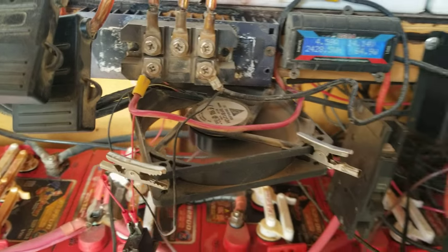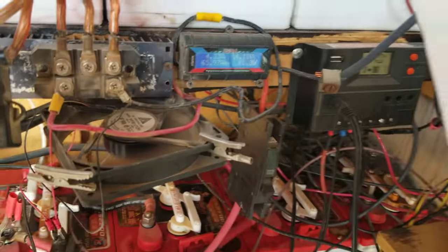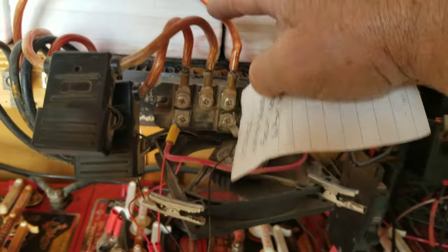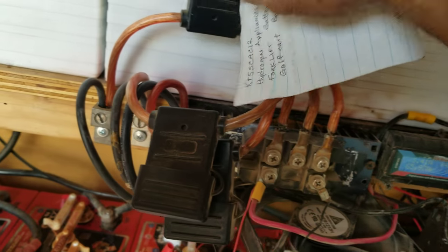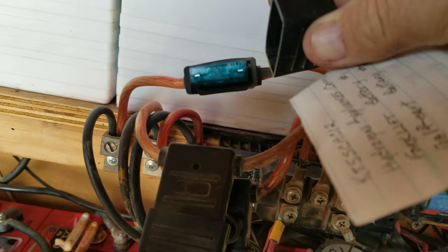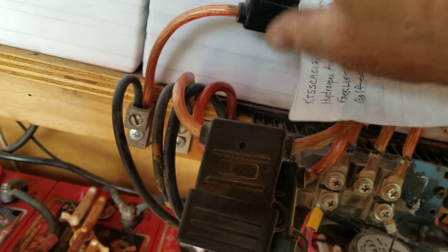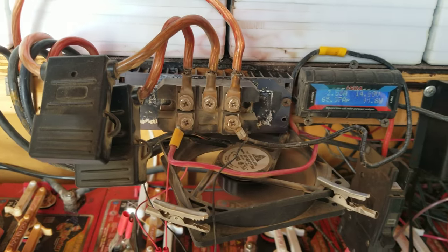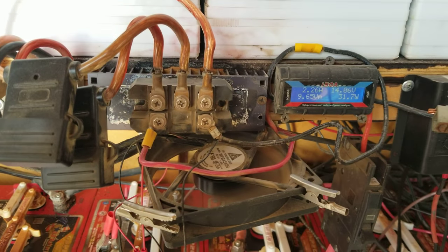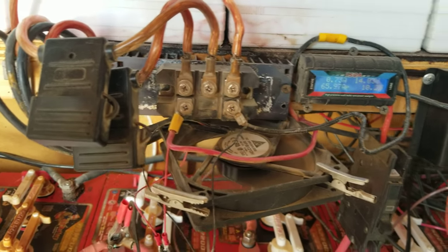Then that goes directly to the batteries — positive and negative — and I put a breaker switch in the positive side so that if I need to disconnect it from the batteries for any reason, I just flip a switch and it's disconnected. These things will put out heat — they will get very hot — so you do want to make sure you protect them with a heat sink and a fan. Don't just trust the heat sink. Put a fan on there also. The 60 amp fuses are there to protect from over-voltage, but you have to be at 90 mile-an-hour winds before I have to worry about that. A little over a thousand watts peak is what I've gotten out of that in the highest winds here.